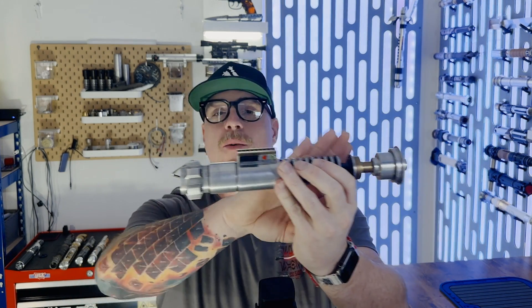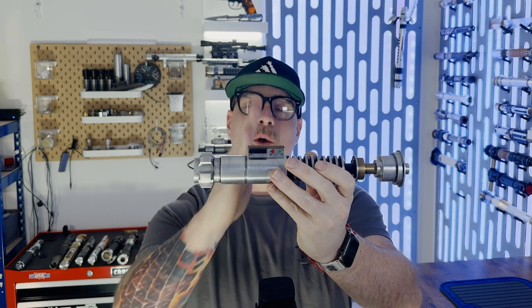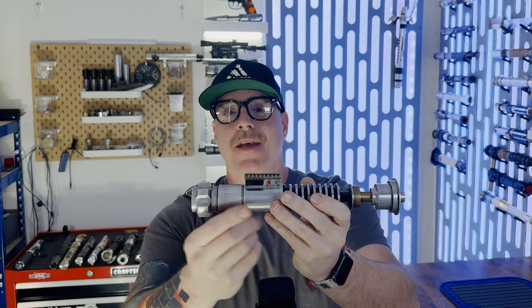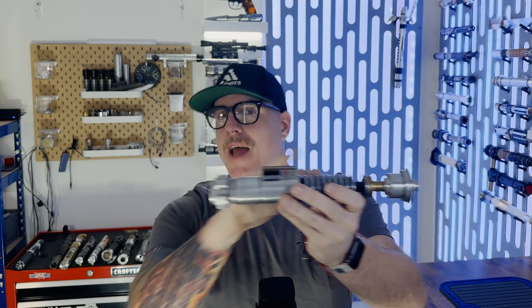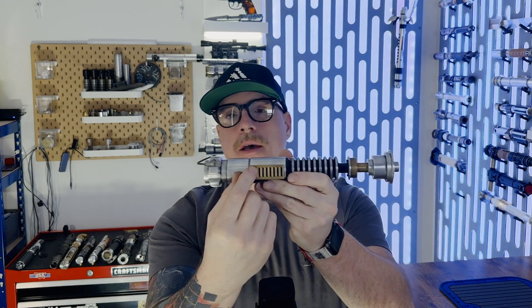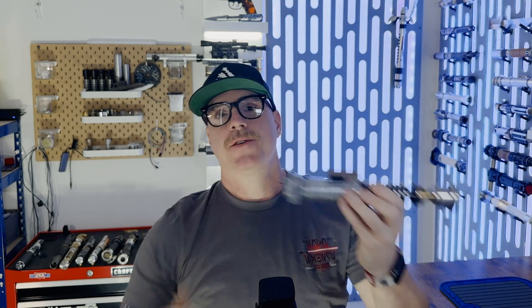Typically with hilts like this, where we've got a control box down low, it's not only difficult to wire up your switches and the LEDs for the arrows, but you've also got to make sure you've got a chassis system that works. There are different options for getting this control box to be wired up to the main chassis. You can do it with spring connectors — I chose to go with a static chassis. The other big challenge was that it did not have a helper board. The helper board is basically a PCB that sits in the control box with onboard tactile switches and onboard LEDs. I did not have that for this install, so I had to manufacture and design a solution for that.